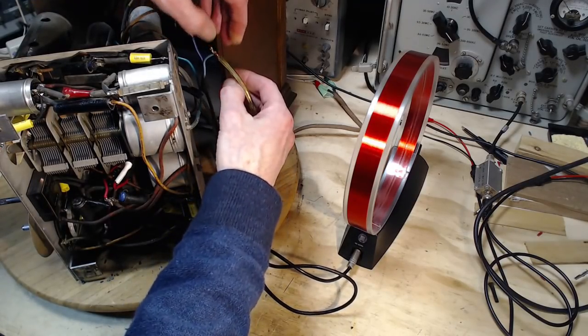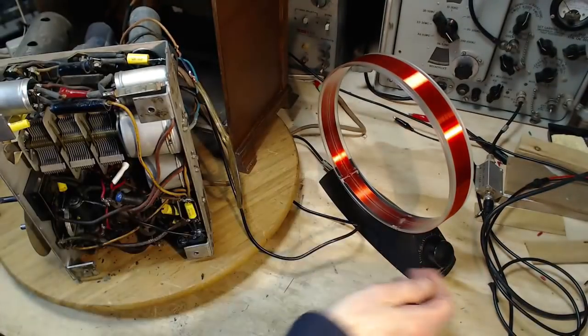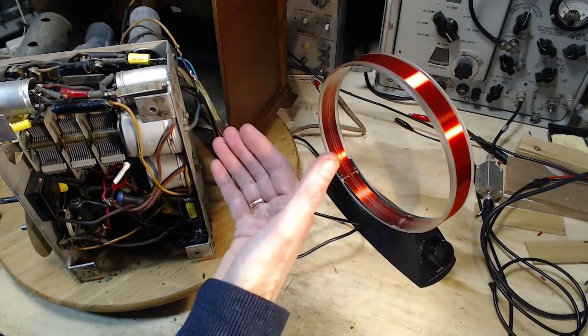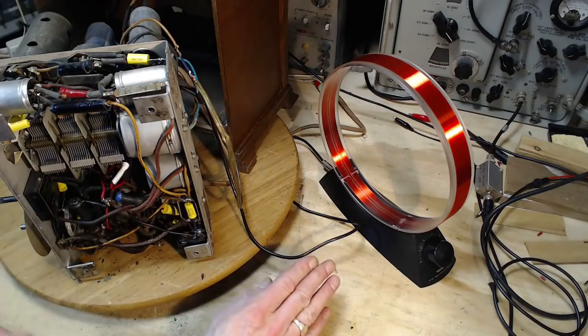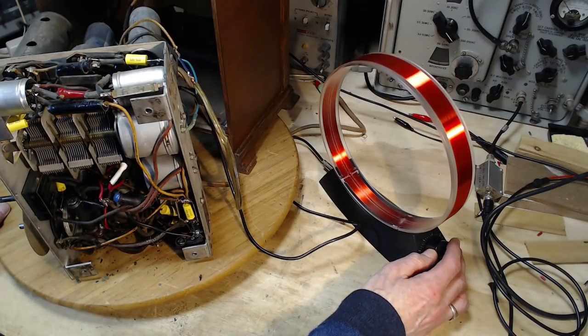Oh, pretty quiet so far. Okay. Flip this around this way. Tune it. Now, when you're tuning something like this, the radio has an AVC. When you first encounter a strong signal, the AVC is relaxed, so a lot of volume comes out of the speaker, but then within a fraction of a second, it knocks it down. It gives you this rushing sound as you tune right in.